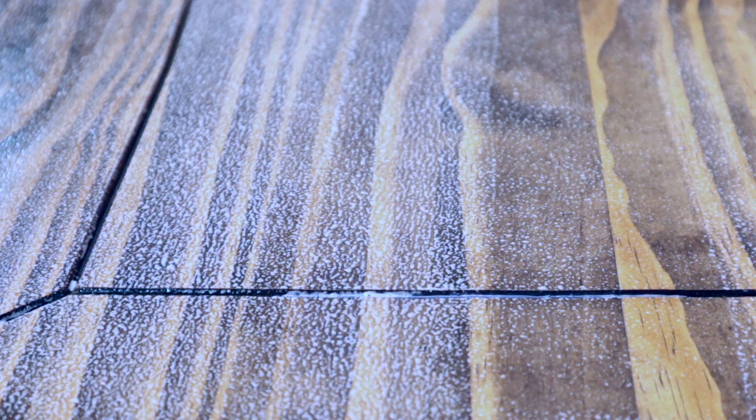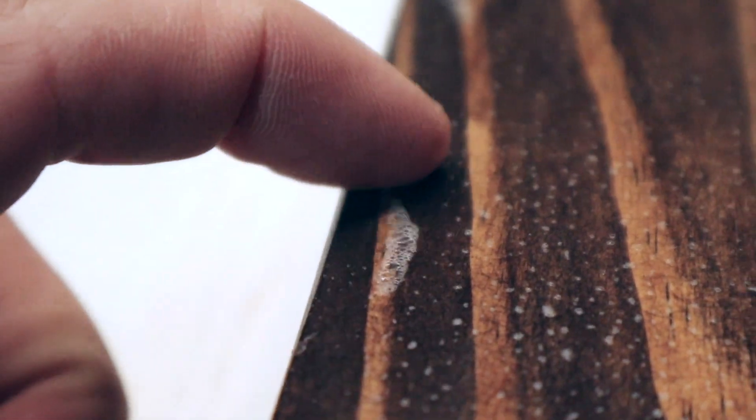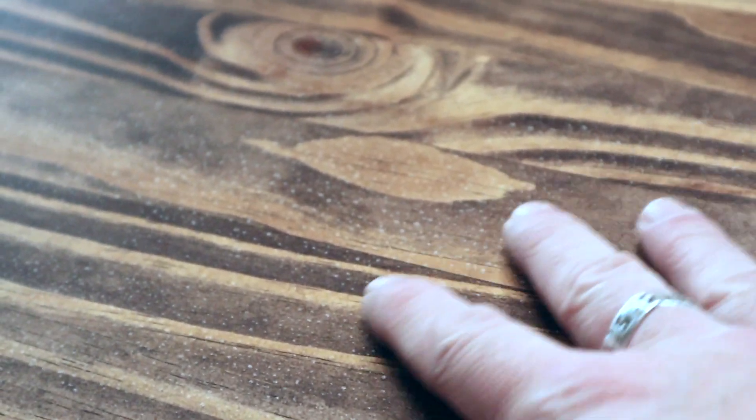Here's a time-lapse — relative time is about three and a half to four minutes on this clip. You can see some of the bubbles starting to dissipate and lay out. However, without tipping, here's 10–15 minutes later: those are hardened bubbles. Those are not going anywhere no matter what you do. That's a problem. If you look over here it looks like dried soap — it's freaking unbelievable. You're really going to have to do something to cut these peaks back down, whether it's scuff sanding or getting back after it.